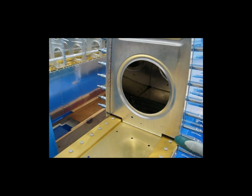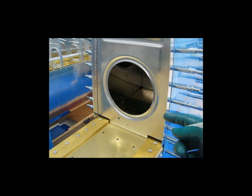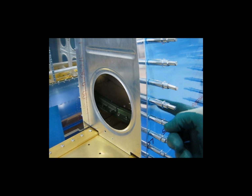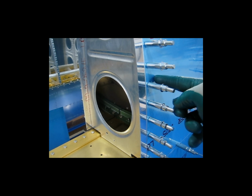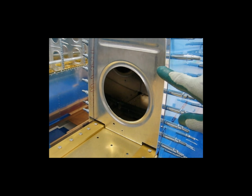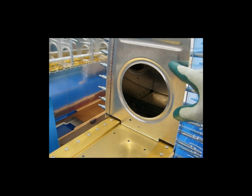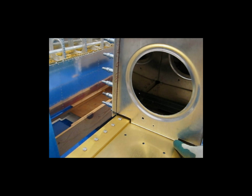According to the instructions, I went ahead and marked the line on the outside, 1/2 inch from the edge, 1/2 inch over. Actually, it would be from this edge. From this edge of the strip here would be 1/2 inch over. And then I took this rib on a bench and this strip and pre-bent this strip to the rib. Brought the rib over, cleco-ed it back in place,